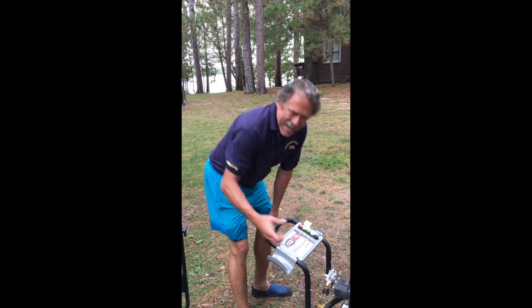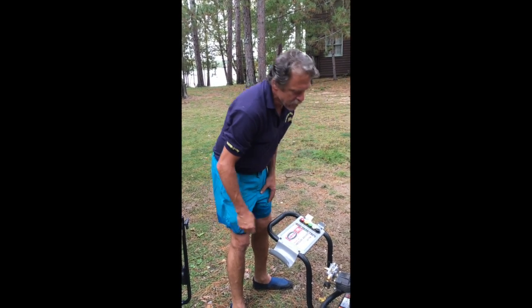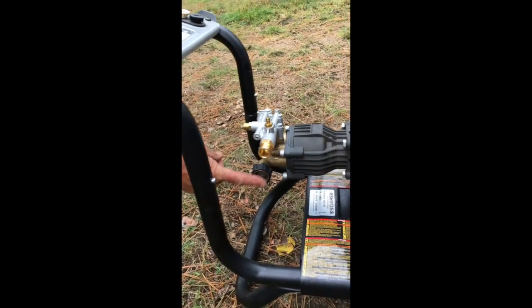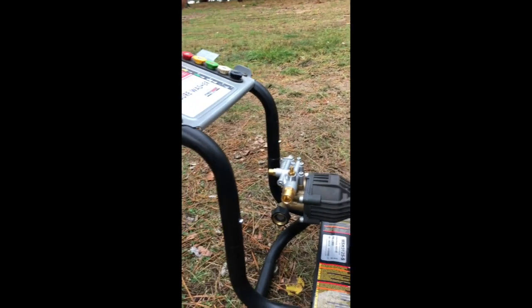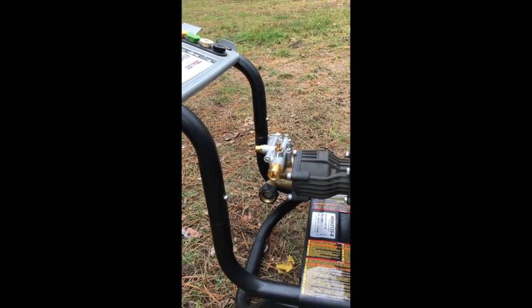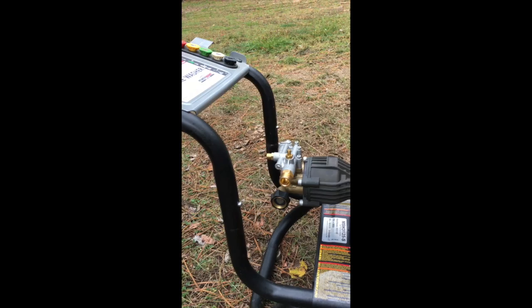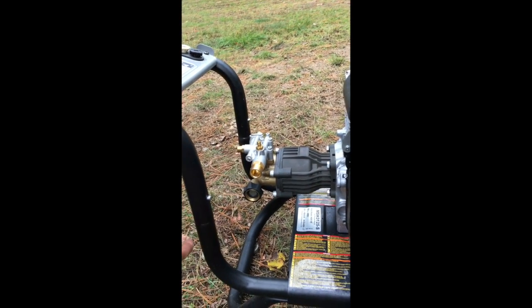I don't even hook up the hand hose. Now the water hose is here, the hand hose is here. The water hose — hook it up. Make sure there's no sand in the hose, because a lot of times the hose is laying there and the rain will splash sand into it. This pump works off of friction and sand is going to cause some issues.